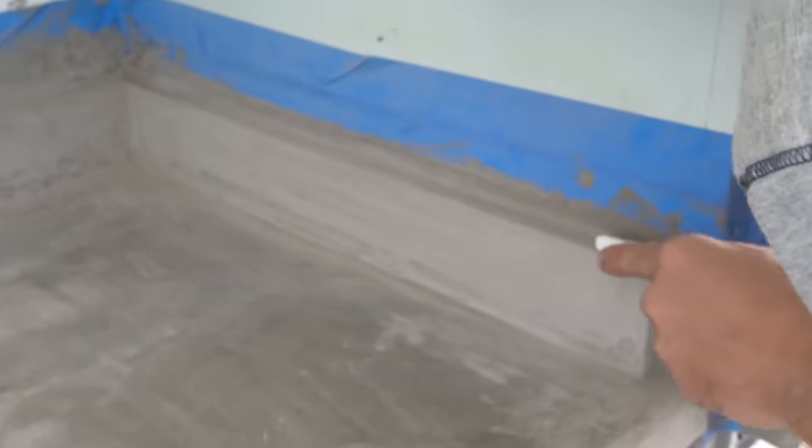You can clean up any concrete residue around the sink with a chisel or a wet rag easily. This is the concrete sealer everyone seems to be recommending online and I got pretty good results — I bought it from Amazon and I'll leave a link below. First, it called for me to saturate my concrete counters, so I sprayed them down and mixed up 50% water and 50% sealer — this helps it soak in better. On the second and third coats we'll apply it full strength. The directions recommended using a clean cloth to apply the sealer, but I used a foam brush and got a few brush marks, so it might be better to use a cloth. Make sure you use a sealer with a top coat, not just a penetrating sealer, so your concrete is as protected as possible against stains.